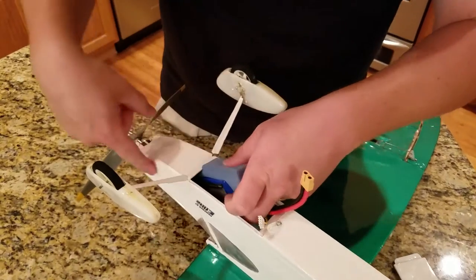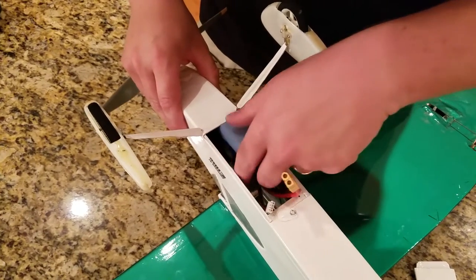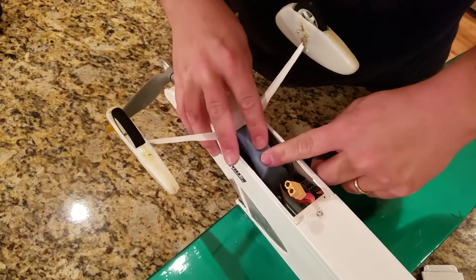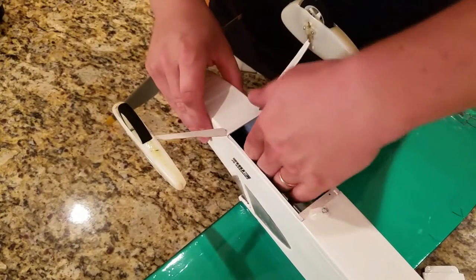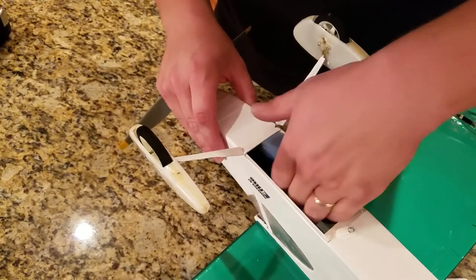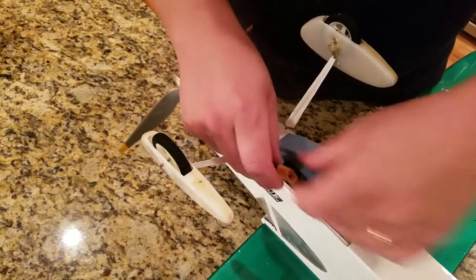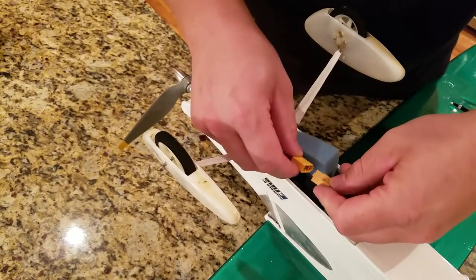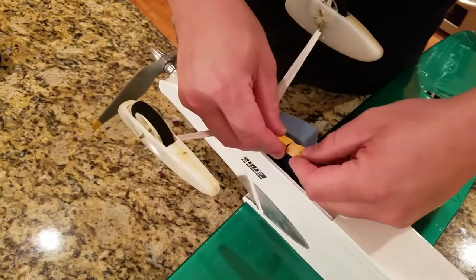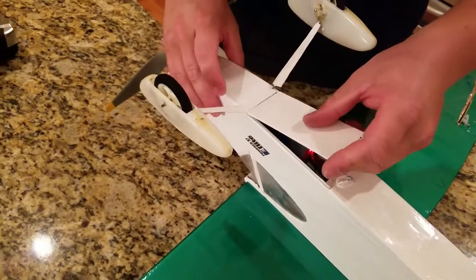You can see the ESC is mounted along the side here, so the ventilation should come in and go around the battery and everything. I work it until it's basically all the way forward, then compress the foam down to hold the battery a bit more. I grab my leads, which are soldered directly onto the ESC. Then radio on first, throttle cut on, timer cleared, plug it in, and we'll give you a quick rundown on how all this looks.